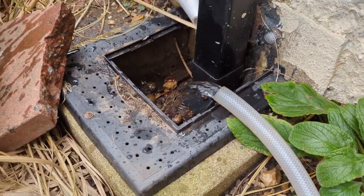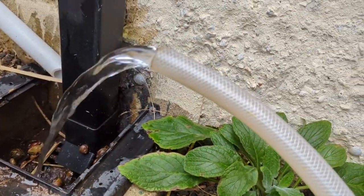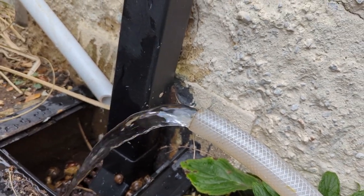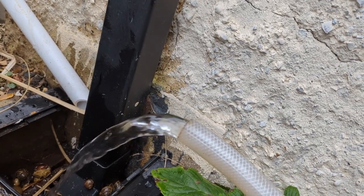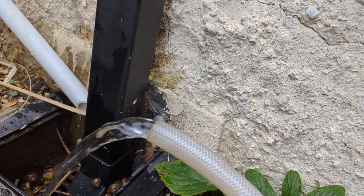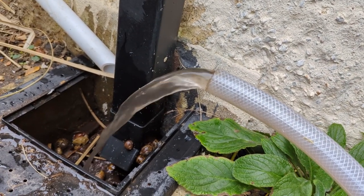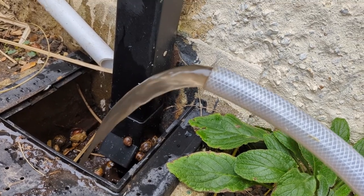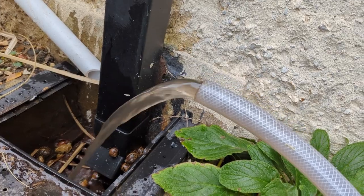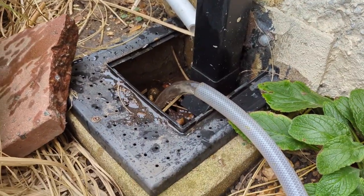Switched over to the next radiator — let's see how long it takes for the dirt to start coming through. We can't see much dirt yet... here we go, here we go — look at that! Dark sludge coming through on this next radiator. Again, just going to let that run clear and test again with the turbidity tube. Once we can see the X at the bottom we can move on again.